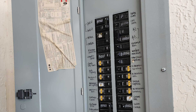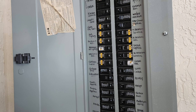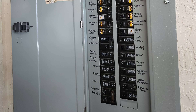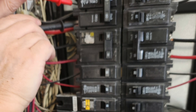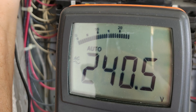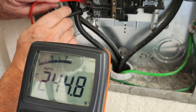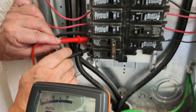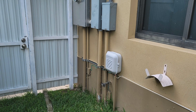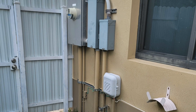Therefore, we need to check the voltage in the main electrical panel of the entire house — typically this is where the voltage line to power the pool control panel begins. We open the panel and see only two breakers with two phases. Checking the voltage at the output of both using the AM1060 multimeter shows 240 volts, so everything is fine here. There are no breakers for pool equipment in this panel, so let's start from the beginning with the voltage input into the house as a whole.